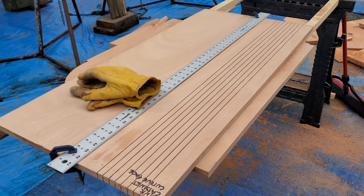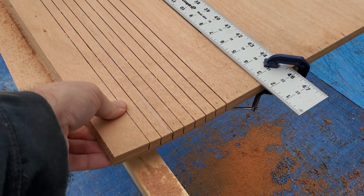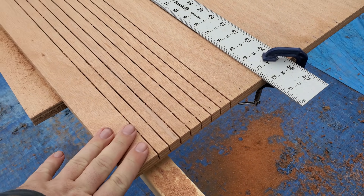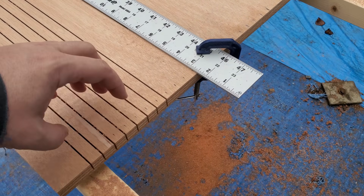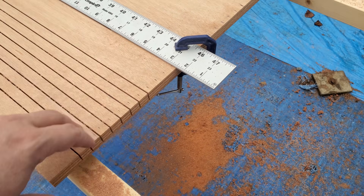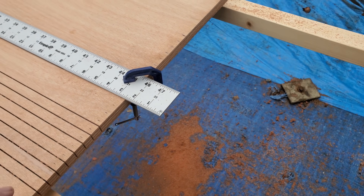We are making progress — I've got several of the cuts made. This little Makita skill saw is working out fantastically. Everything is just bending up for me and giving me that nice tight radius. The depth of cut seems really good. I'm just clamping a straight edge down as a guide. I made all my marks an inch and a half out from where they needed to be, so by the time it comes over, the last cut will be seven and a quarter from this end.